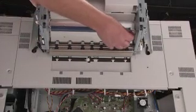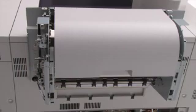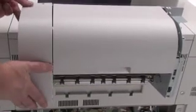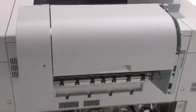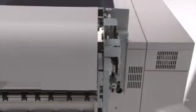Lastly, I'm going to remove the final piece of packing material from the top eject unit. The key to putting the top eject unit covers on is to pay attention to the little guides — these guides need to line up with the sheet metal bracket. I'm going to slip the right cover into place and secure it with the screws. Next is the left cover of the top eject unit — sliding in from the rear and fastening the four screws I'd taken out earlier.